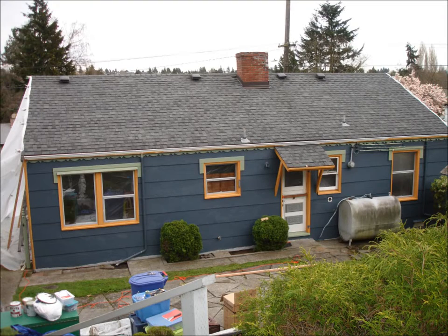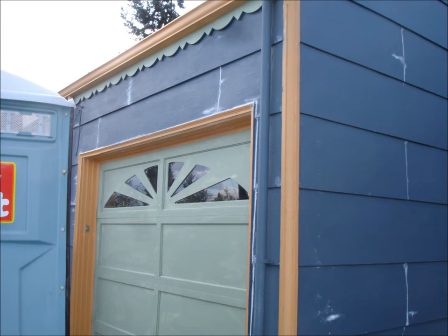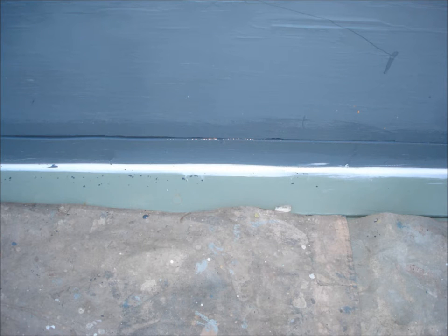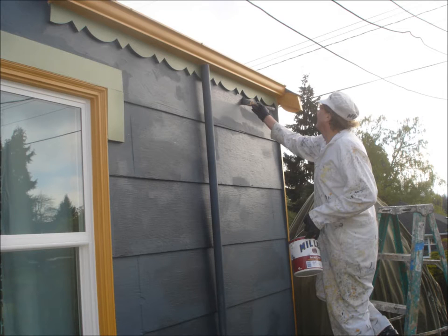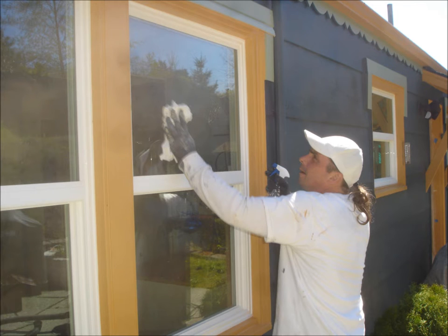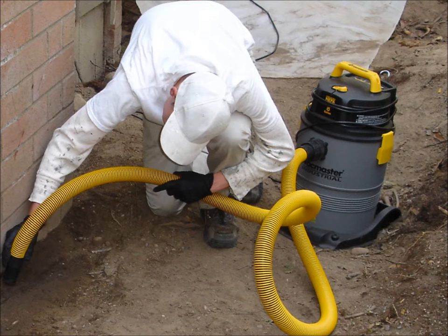Here are views of the front, back, and side of this fully prepped and primed house. Caulk everything thoroughly and complete any other necessary repairs. Notice the properly caulked garage — north side, front, and large ground-level gap. Clean gutters before the final coat and make sure that everything is protected. Apply the top coat starting at the top of the house and working towards the ground. Clean all outside windows; use a razor blade to remove the tiniest of flecks, then wash windows with mild cleanser and clean cloths. Do a final sweep around the entire house using two workers, each with a HEPA vacuum, one following the other to ensure nothing is left behind.